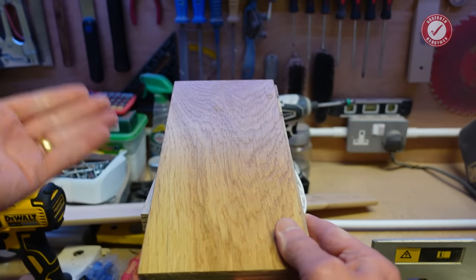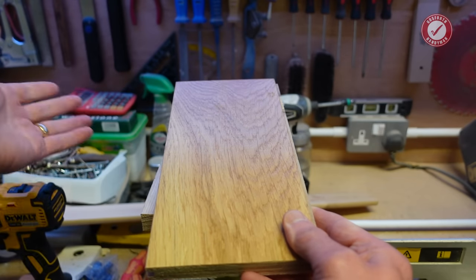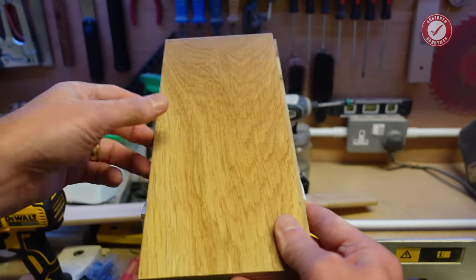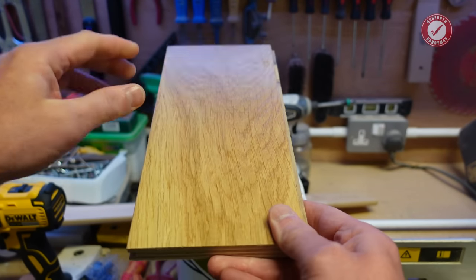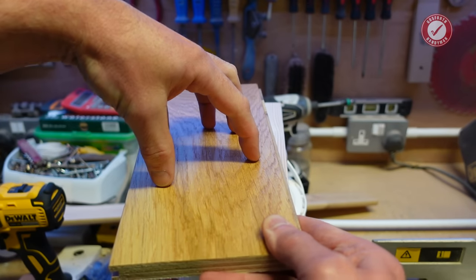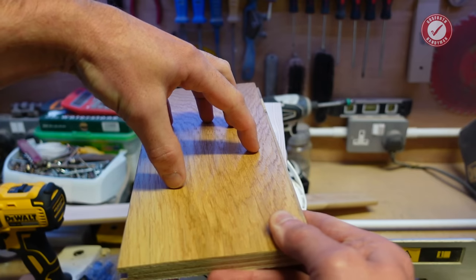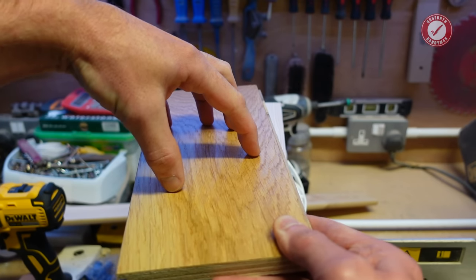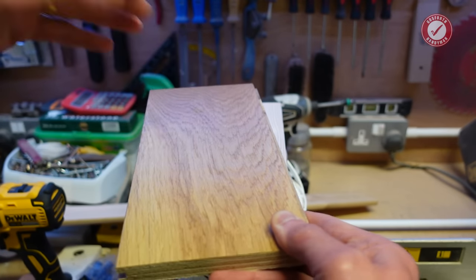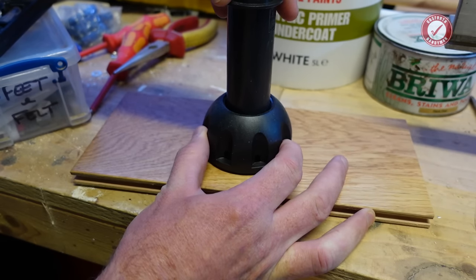Having said that, if you are fitting it for a customer, you need to follow all of the recommended instructions to make sure that you don't have any comebacks later down the line. Personally, I think kitchen legs on a unit sitting on top of this — the wood would be able to move that one or two millimetres of its own accord anyway. There's more than that in terms of play in the plastic legs, so even if the unit above it can't move, the legs would have that play in it. So the legs aren't an issue.